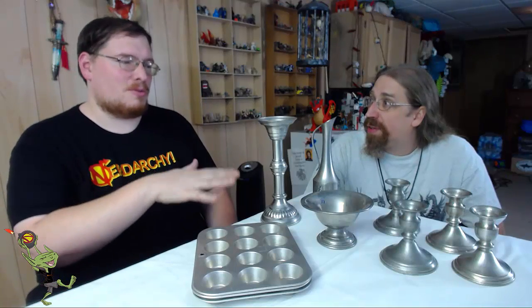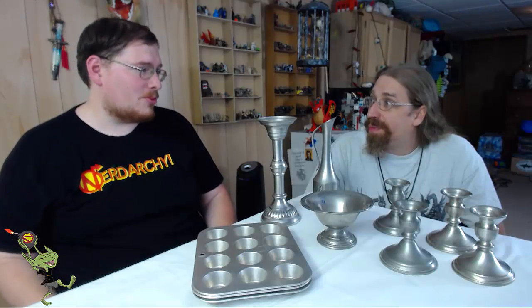Yeah, the trick with metalworking, especially with pewter, is that it's easy because everything you use pretty much has a higher melting point than the pewter does. So the trays that you use just for baking corn muffins have a higher melting point than it, and so does the stovetop stuff that you use, again, because the temperatures on a stovetop can get high enough to melt pewter.